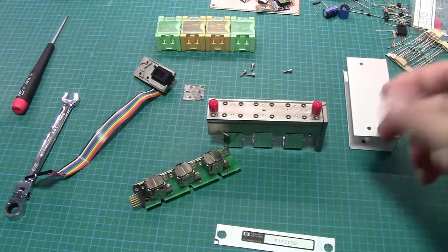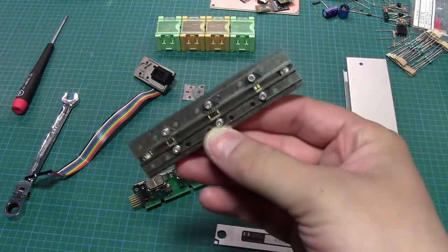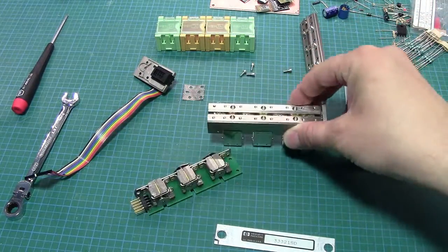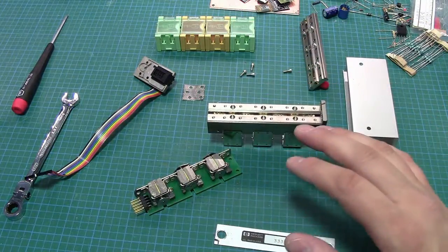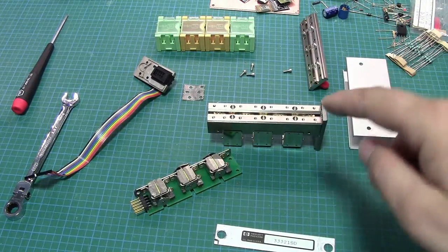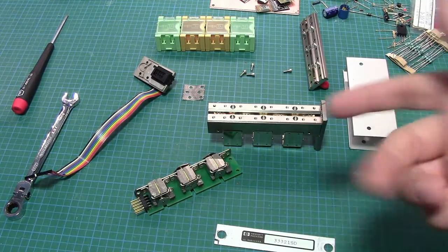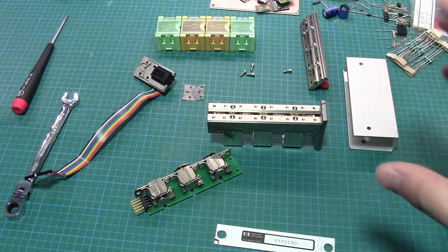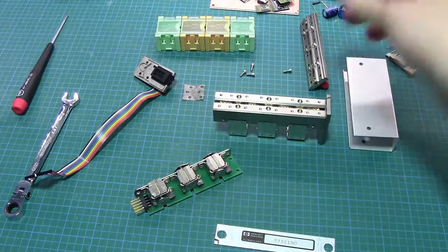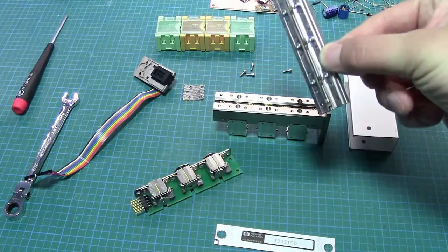Pardon me. So what I ended up doing was pulling off the attenuator pad. So this is the attenuator pad of one of the eBay attenuators that I bought, and replacing it using the good mechanicals and electrical parts from the eBay attenuators and the original pads that came on the attenuators with my 8642B. I was able to basically create a full attenuator that worked properly. So these are the mechanical electrical parts from the original attenuators and the pads from the eBay attenuators.